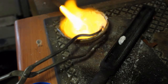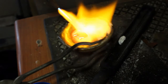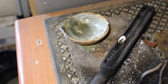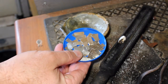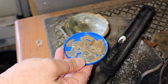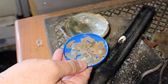I've added all the metal now and I'll be pouring the ingot bar. From there I'll roll all the metal thin and do the second melt. I've rolled the first bar of white gold and snapped the pieces into small bits. I did not anneal in between — I just rolled the bar straight from start to finish to approximately half a millimeter thick and snipped it into pieces with the tin snips.